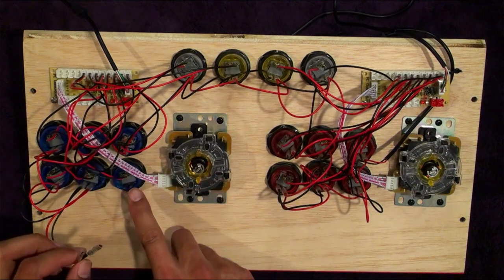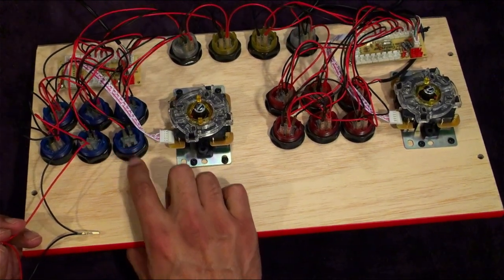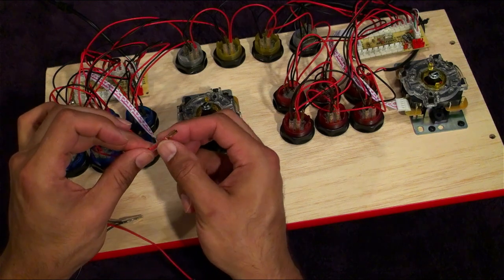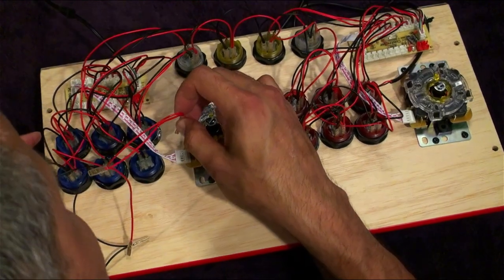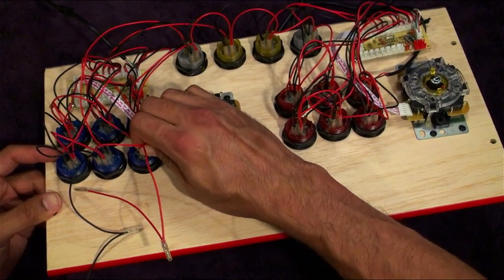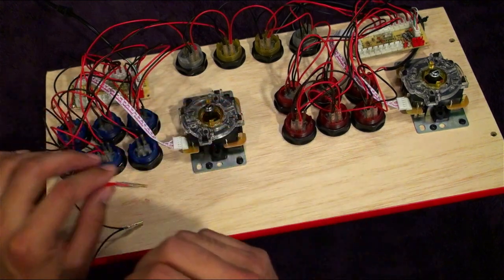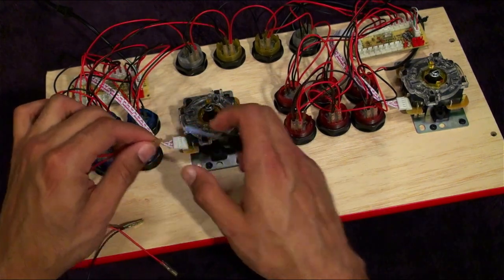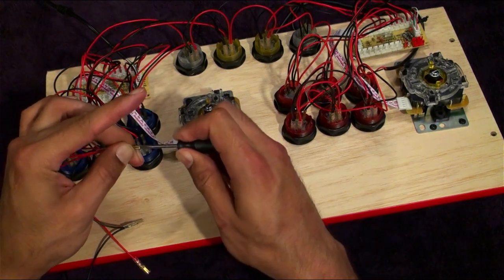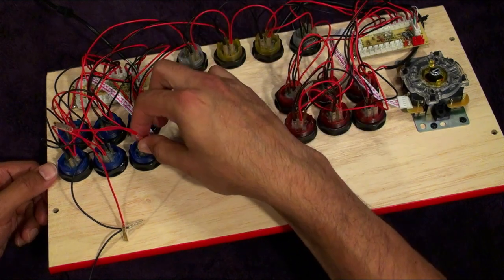So yeah, basically all you do, you got the positive. You guys can see that. Positive pin here, negative pin here. So I just pull the protective sleeve down a little bit. Get that positive terminal pin on there. Just wiggle it down a little bit so it goes through. Now, if it doesn't push all the way in, it always goes halfway and that's it. I just got a small little screwdriver and just push it in the terminals just a little bit to open it up a little bit. And then try again. All right, there you go. Now it pushes on real secure.